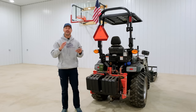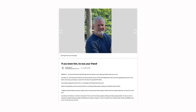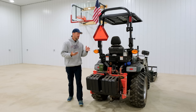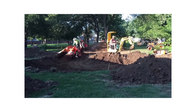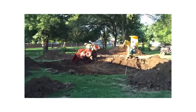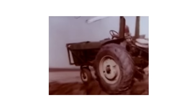Even on flat ground, something bad can happen. This gentleman found a rut — just a dip in the ground — and it was enough to overturn his tractor. It ended up killing him. This gets back to always being aware as an operator. If you can have more weight on your tractor to keep the center of gravity low and planted to the ground, it's going to improve your chances or limit the chances of a rollover, though it doesn't mean it still can't happen. Don't daydream while you're on your tractor — tractors are more dangerous than you'd think.